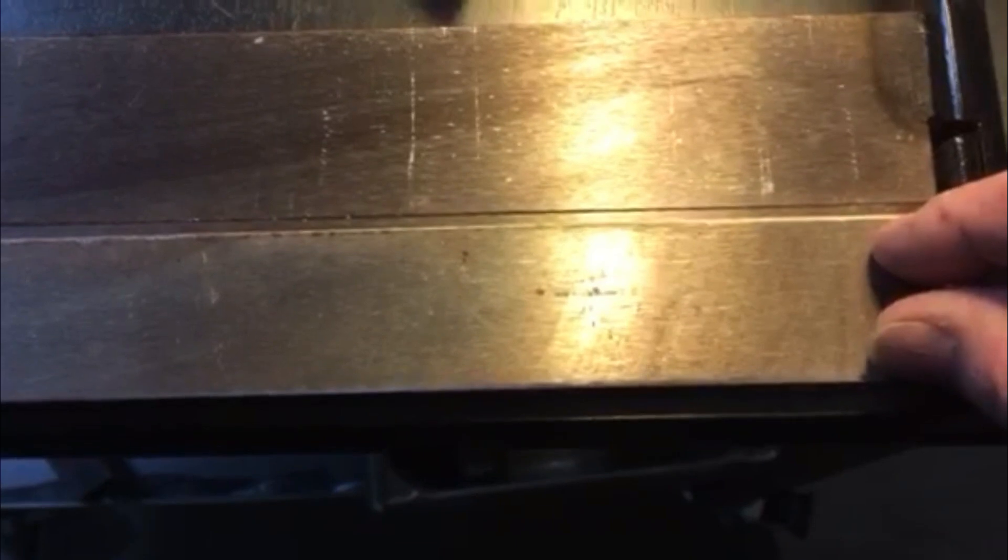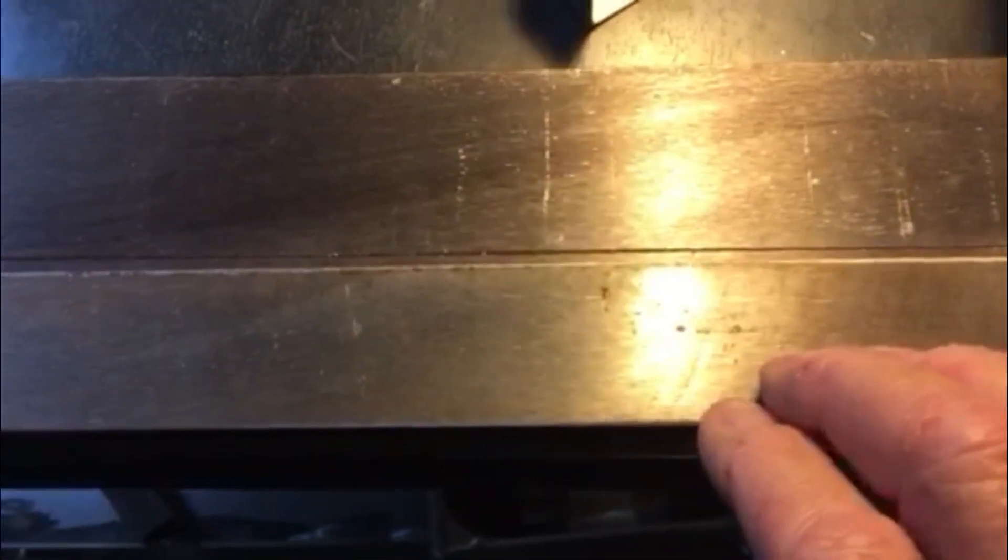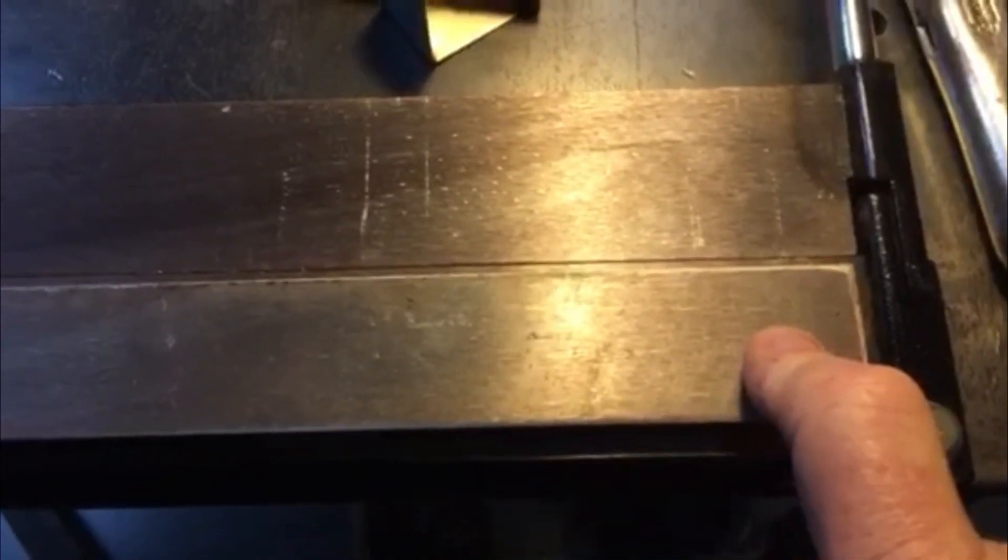What I've noticed, and what I'm going to go ahead and do since I'm just using the .05, is weld a piece of quarter-inch by three-quarter-inch steel plate and stitch-weld it right on top. Then I'm going to put another piece — quarter-inch by three-quarter-inch — so this doesn't move at all. And if you're doing steel, you surely don't want it to move. After that, I'm going to drill holes to accept three-eighths-inch bolts and put a steel nut underneath.